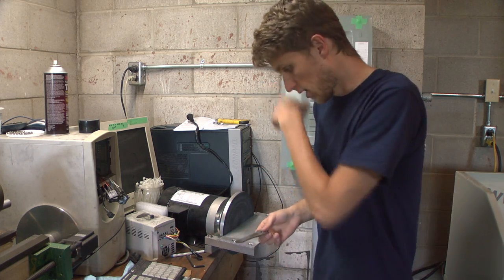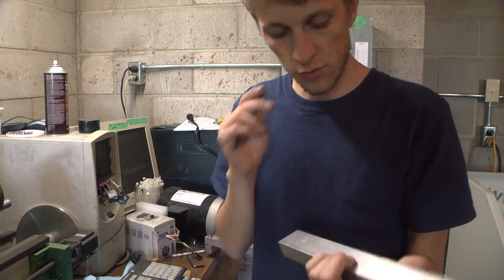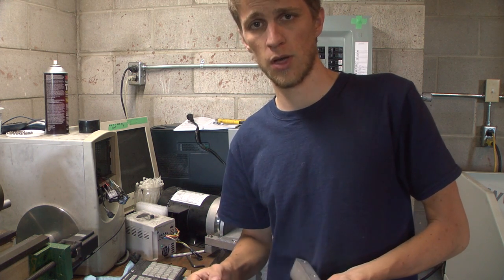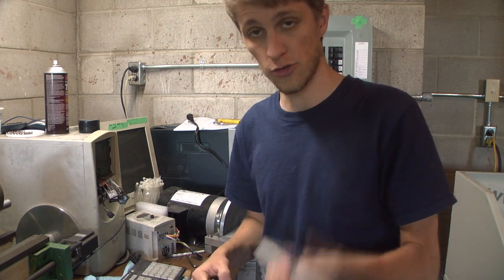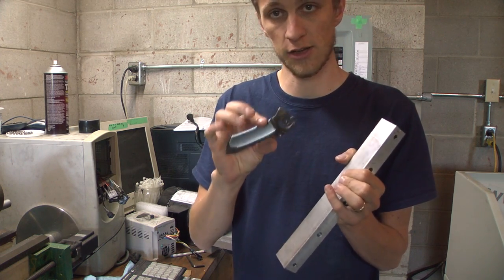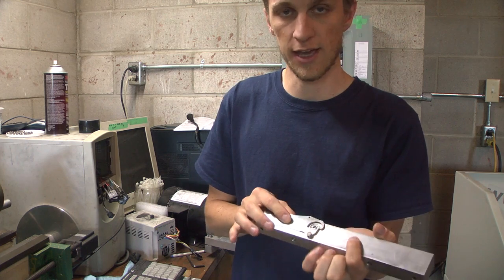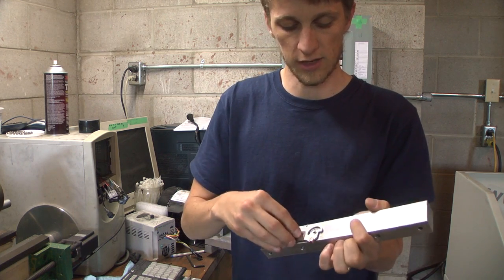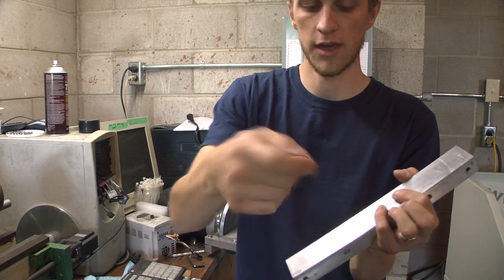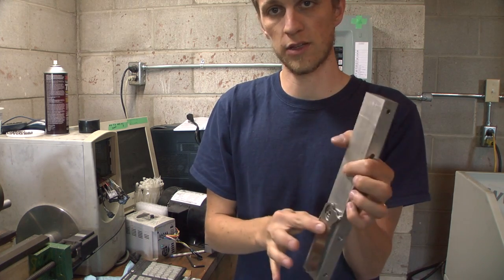So that's dumb. So what I'm going to do is take a big chunk of aluminum. This was suggested to me a few weeks ago, maybe a month or two ago, on one of my videos by a YouTuber. Posted a comment, said take a chunk like this and mill out a pocket that's pretty much the same size as your blade so that the blade fits inside. He said think of like a French fitted case. So the blade will kind of sink inside, maybe halfway down, and then I've got little magnets here that are going to press into the bottom of the pocket so that the blade will get sucked in and will be held in perfectly.